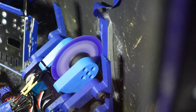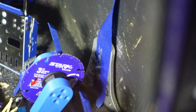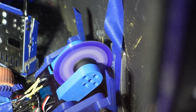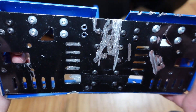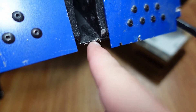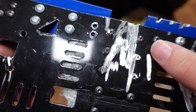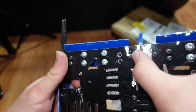Here you can see trying to cut through the quarter-inch aluminum upright that I was attacking before — this time still not very successfully. I think that mainly aluminum is just building up chips inside of the grits or between the grits on the saw and preventing it from cutting, whereas something harder like steel tends to wear away. You're getting very close but not quite through. You can see there's literally like a line where it's bent the aluminum up, but it still didn't quite get through it, even going through a screw in a couple places. Kind of cut through that one there, and this one here, and this one here. Took a chunk out of this one there too.